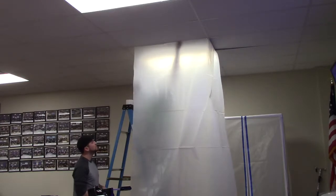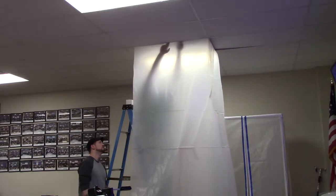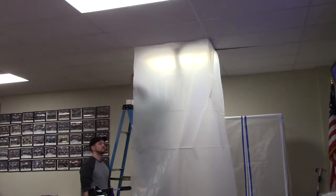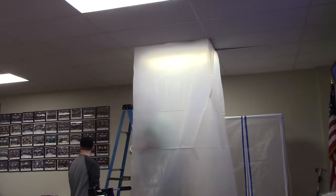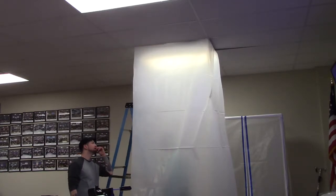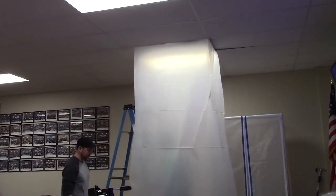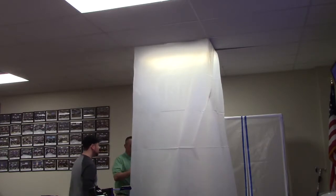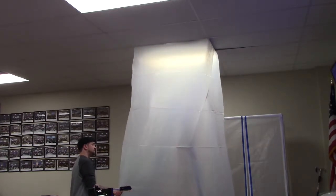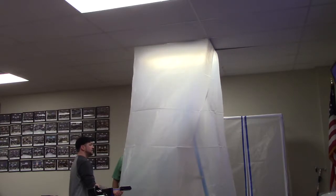Over here on this side we're going to lift it up and do the same thing: tape it up across the top, then drop the tile right back down. Question from Shane: why on the other side did you put it lifting one way, and on this side the other? It makes no difference. It's just that there's more room on this side for the ladder than on that side. Sometimes we're going to be restricted like that out in the field — we don't have room for the ladder, so you're working inside the containment versus outside the containment.